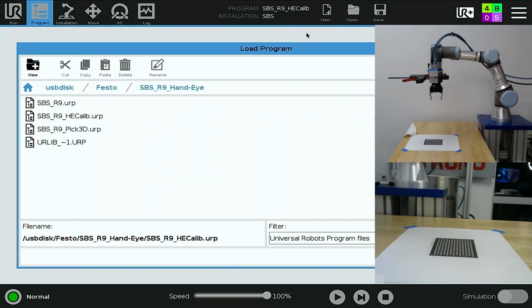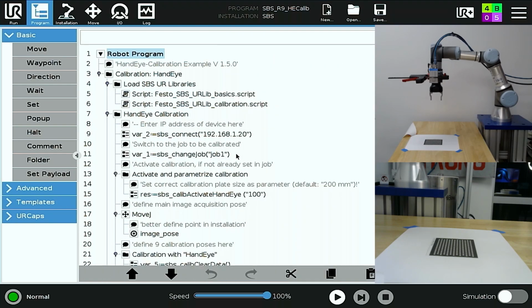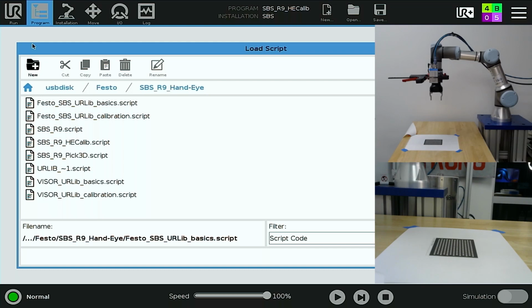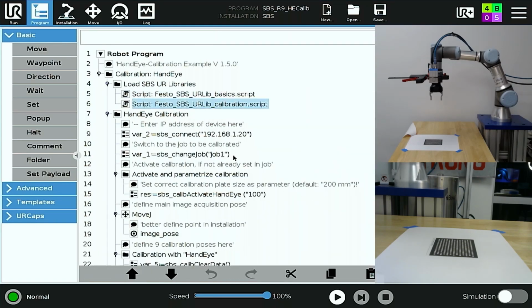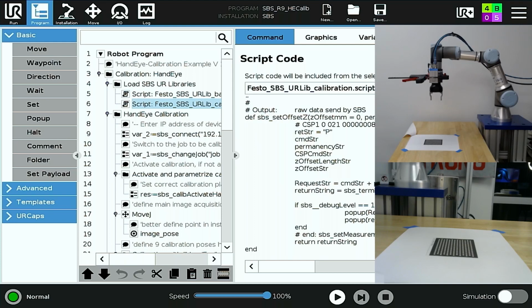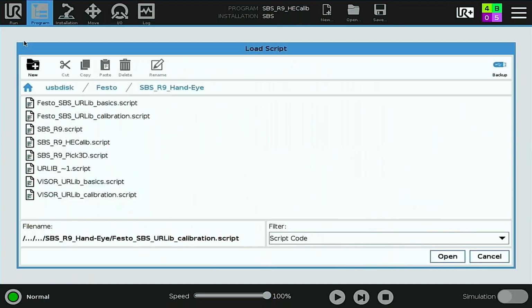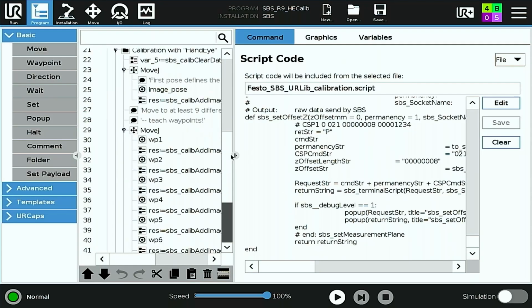Next, I'll open my hand-eye calibration UR program. You can see that listed in the description. Then I'll go about loading the basic script by clicking Edit, Open, navigating to my basics.script from Festo, clicking Save and then Exit. I'll repeat that process for the calibration script as well. Edit, Open, navigate to calibration.script, save and exit.